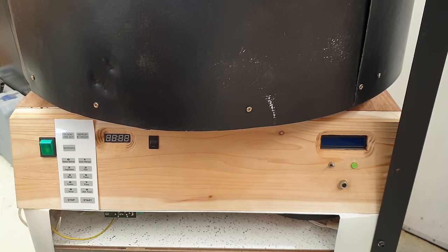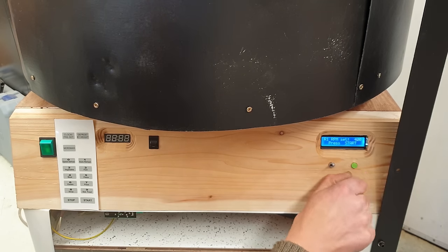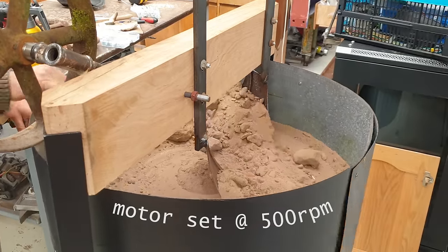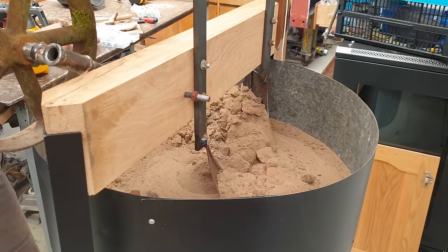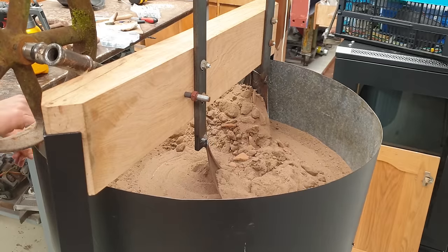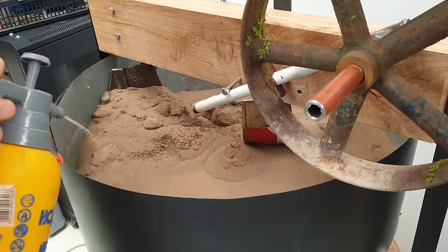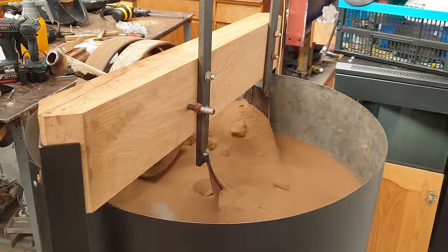Here we go. Turn it on. Okay, set the speed. I'm going to start. And we're off, except we're not, because at that speed the motor just can't produce enough torque to really turn this thing round consistently. Even with the 16:1 pulley reduction, it's really struggling. And admittedly this is slower than it needs to go. I think probably we want the bowl going about 50 rpm or so. Here it is at that kind of speed. So yeah, it runs okay at this speed.